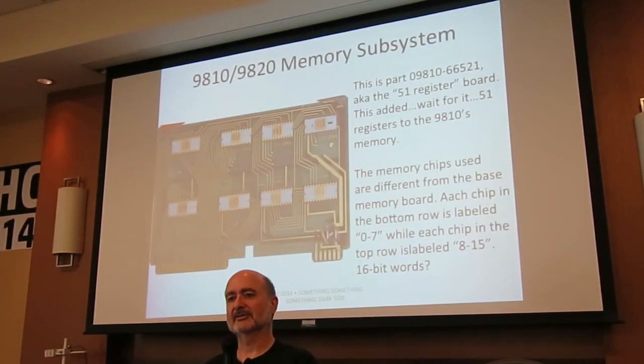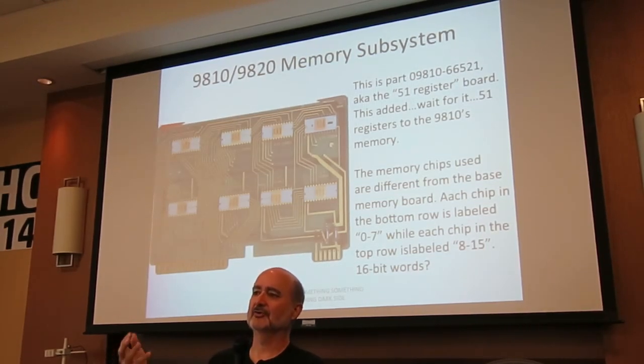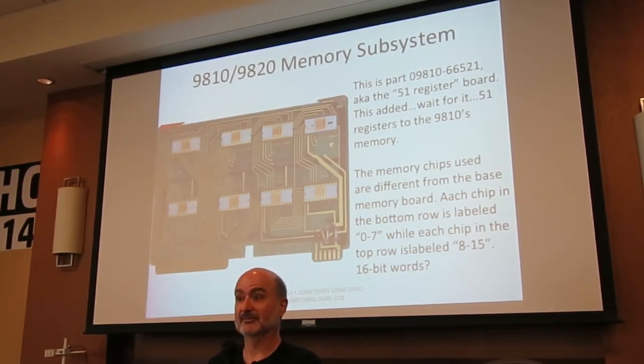That's another nice thing about these old desktop calculators. If you find one of the old handhelds, most of the time you're going to see some corrosion. Even if the owner took the batteries out and it's been sitting in normal humidity air for 40 years, that's not the case with these gold machines. I've never seen any corrosion. It's possible. I've heard it's just the gold plating over tin and it can peel off, but I've never seen it happen. So generally, when you get one of these old calculators, you open it up, blow it out with a can of compressed air, check for any bad capacitors, and generally the electronics just work, which is really nice.